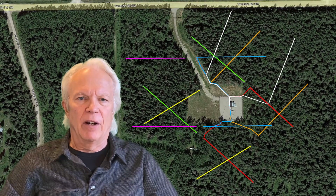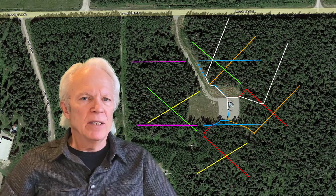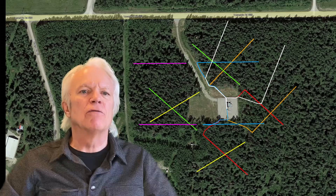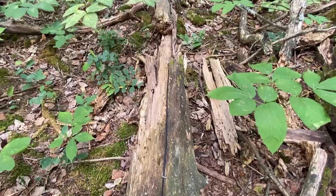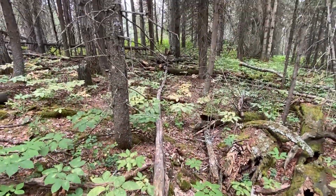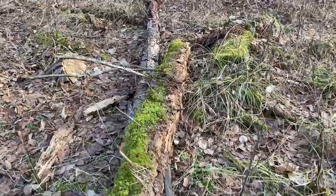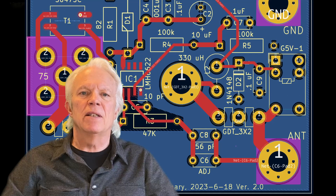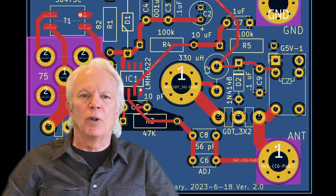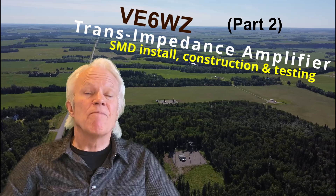BOGs are not a new thing — they've been in use for decades, so there isn't a lot new here. However, I wouldn't have made this video if the performance for these didn't surprise me. The broadside pairs can hear just as well as my old thousand-foot elevated pairs. Maybe you got some ideas from my experimenting and you might want to try a similar setup. These stealthy wires lying close to or on the ground can be deployed in a lot of situations where above-ground wires just aren't possible. Perhaps you already have a BOG installation and you might want to try building some of these trans-impedance amps to lift the gain and perk up the output. Check out my part 2 video for construction details about these amps. 73, this is Steve, V6WZ.